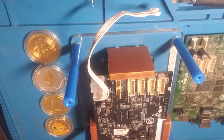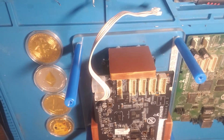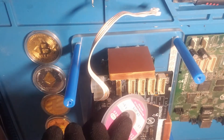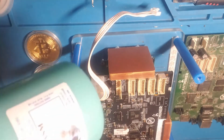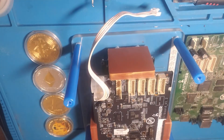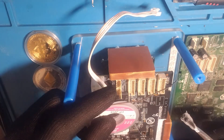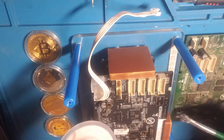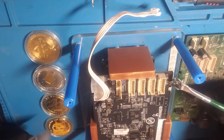So we're going to go ahead and do this right. We have the soldering iron preheated. All we need is a solder wick. The next thing you need is some flux paste, so we'll go ahead and apply the flux paste to the copper wick — apply it directly to the wick and also apply it to what you're working on.